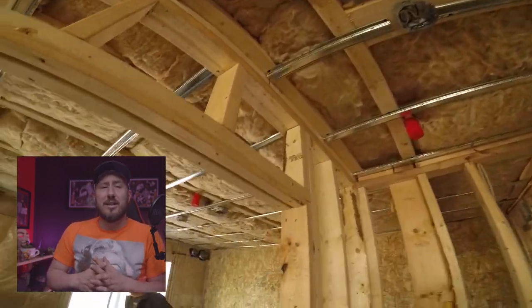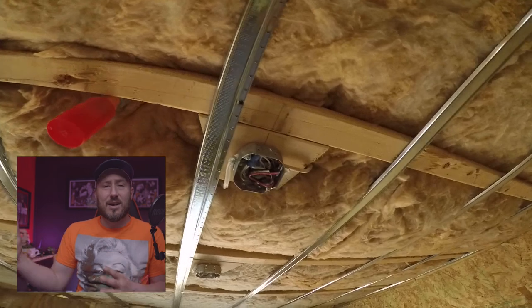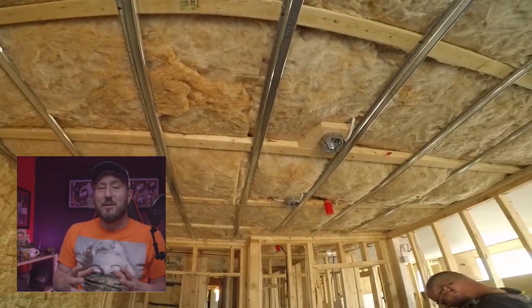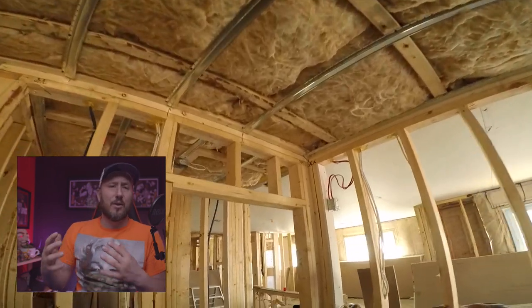The other factor you need to take into consideration is the duct runs — where they'll be — because if you can hide joints inside the duct runs and bulkheads, those will only need to be fire taped, and you're saving a lot of extra work for the finished tapers.